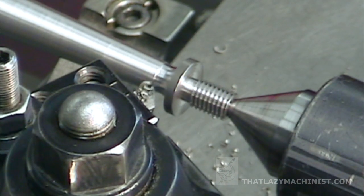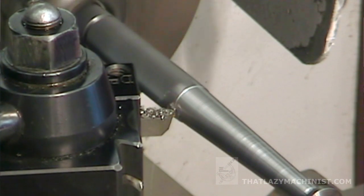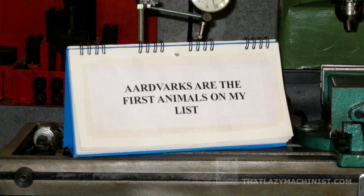That last sheet on the taper turning operations would have been a good spot to indicate the angles of the taper — the total angle and the half angle. That kind of information isn't on the print. On the print we have a large diameter and two radii, and we do some subtractions to find them. So it's important that your sequence of operations contains the results of all calculations needed to produce the part, especially when those numbers don't appear on the plan. The positioning hammer project drawing has diameters and lengths but does not give any angles for the taper on the handle. Since it's always a good time to do a little math, let's head over to the whiteboard and take a quick look at those calculations.